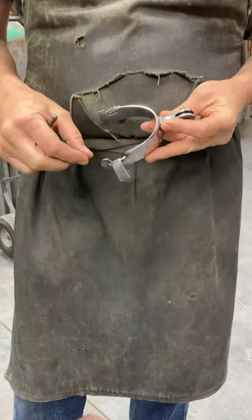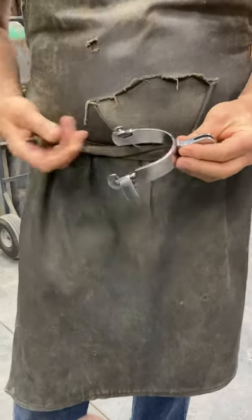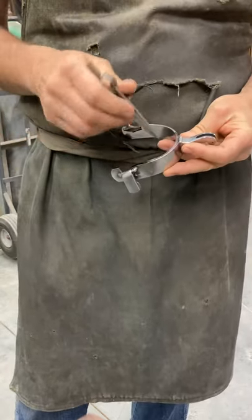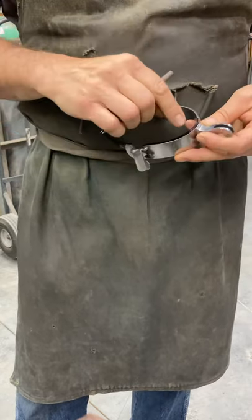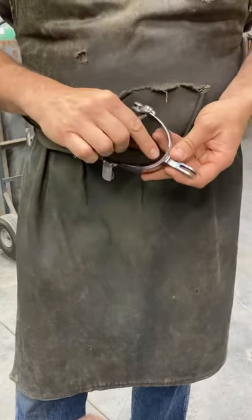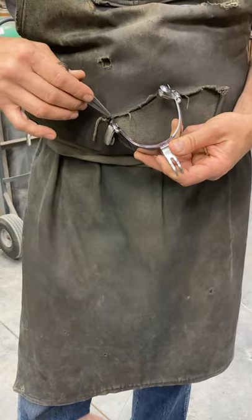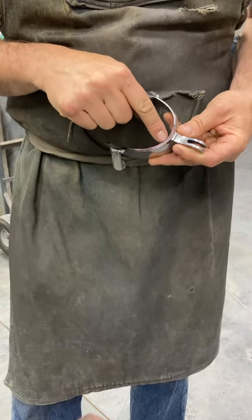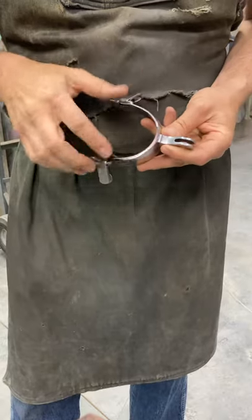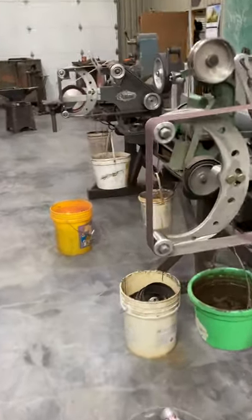Maybe that's a cool thing, maybe that's something you're wanting to do. I kind of like showing the taper — tapered lines create movement with the eye. I'm trying to make the eye move around and think this metal work is really cool before I ever start my decoration. So I'm baking the cake, making it look cool. I'm going to mark from the outside, normally speaking, come around like that, and then I'm going to grind to that line.